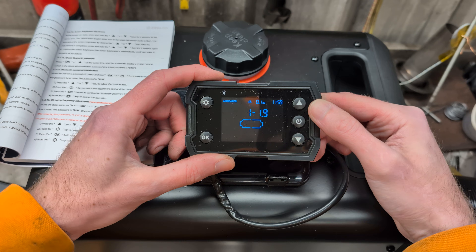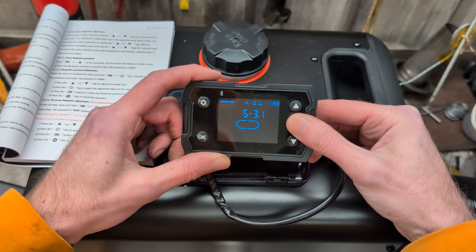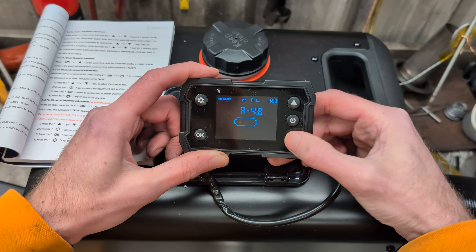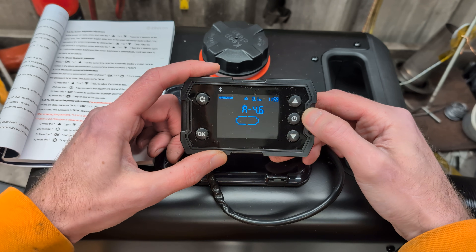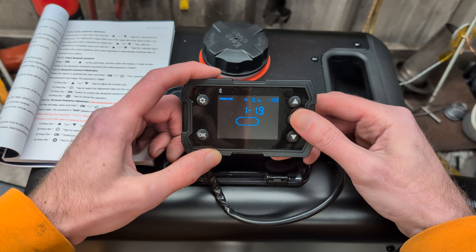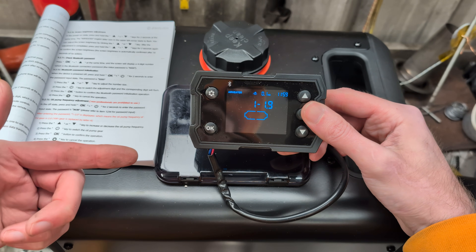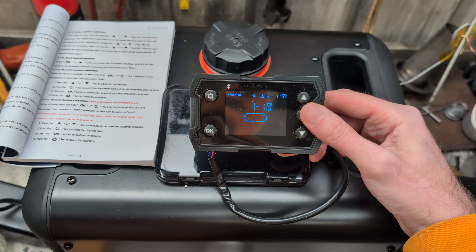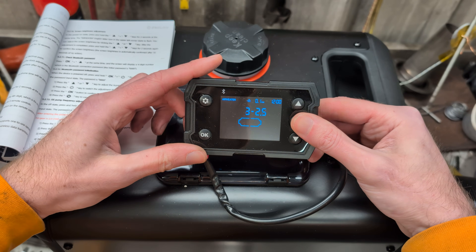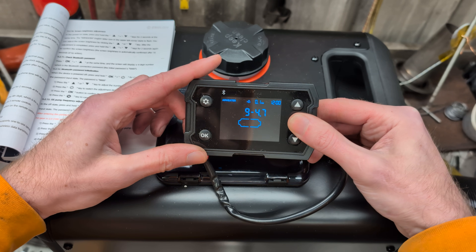You could go through all the levels and tune them all individually, but I'm not doing that just now. I'll never run it at every in-between level. Let's take the top end down 0.2 — so that's the top end setting reduced by 0.2 Hz. You could go through them all: start at level 1, wait for the temperature to settle, take a carbon monoxide reading, move up to the next power level, wait for temperature to settle, take another reading. That way you tune the entire fuel curve of the heater. For me, I'm just going to set a top and a bottom and call it good.